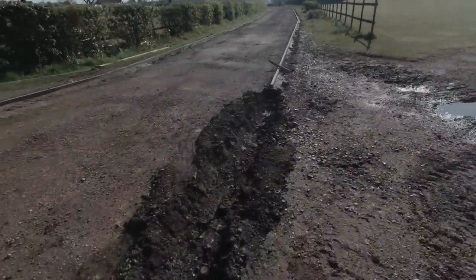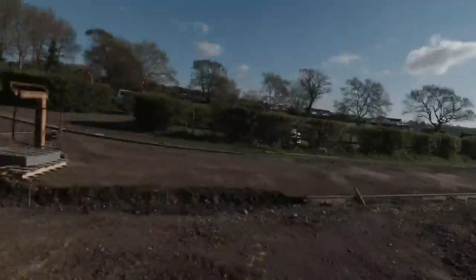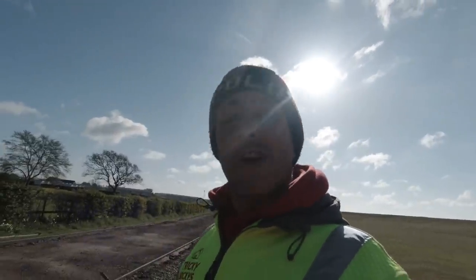And back to 4 metres as we come out of the corner. So that keeps us nice and smooth all the way around the edge, and I can gently feather them round to meet it. So it's the only way you can get kerbs around corners, by gently feathering them round. So yeah, lovely old job. Now we've got our gear mixed up in there, look, whole dumper load. So the next bit is, got my kerbs there as well, so I'm going to get my muck in there now, ladies and gentlemen, and then we can start carrying on kerbing.